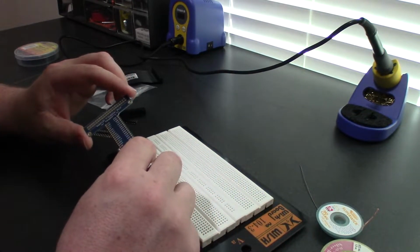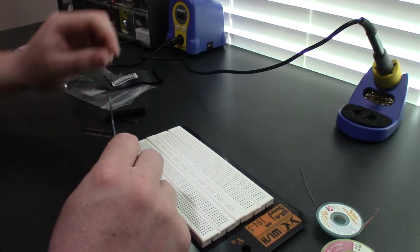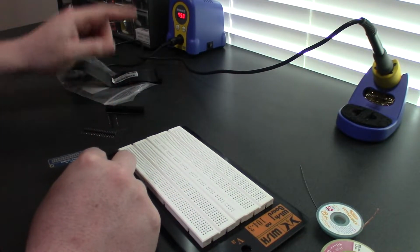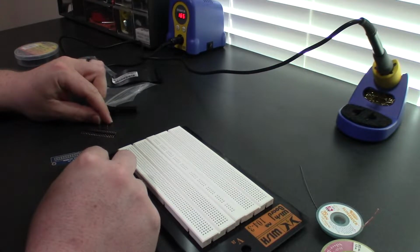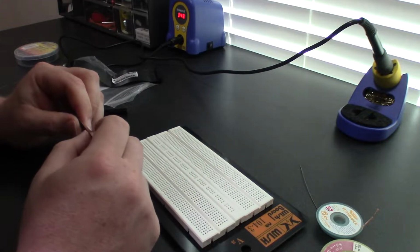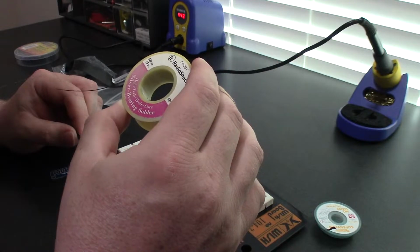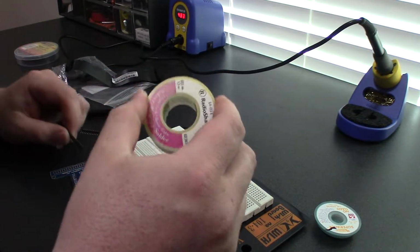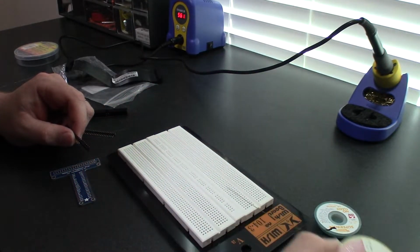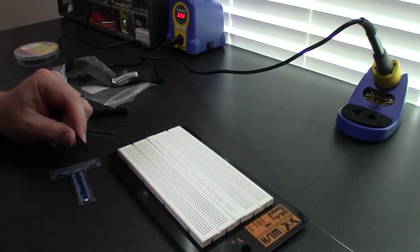So we're gonna do some soldering just because, hey, let's see how it looks on camera. I know Ben Heck did a lot of soldering on the Ben Heck Show, and people seem to really enjoy that. So I've got my Hakko 888 Delta. It's warming up to 700 degrees. I'm using some Radio Shack high-tech rosin core solder, silver bearing at 62-36-2. It's been my go-to solder for a while now. I've had this one for quite a few years, as you can see, but it works well. I also got some Super Wick solder wick in case I need to clean some stuff up.